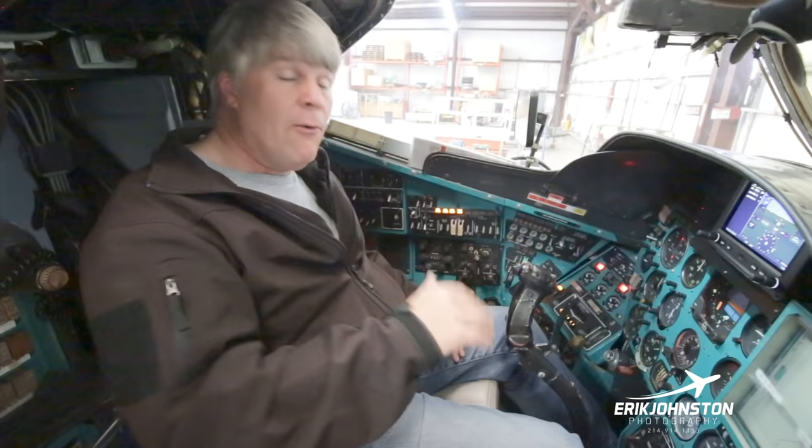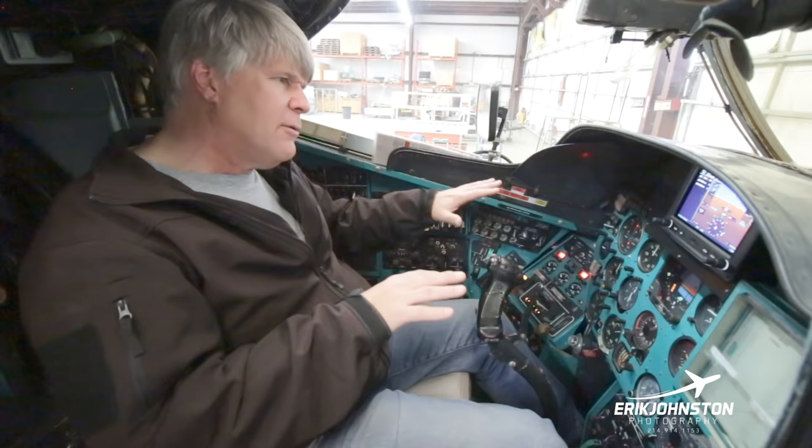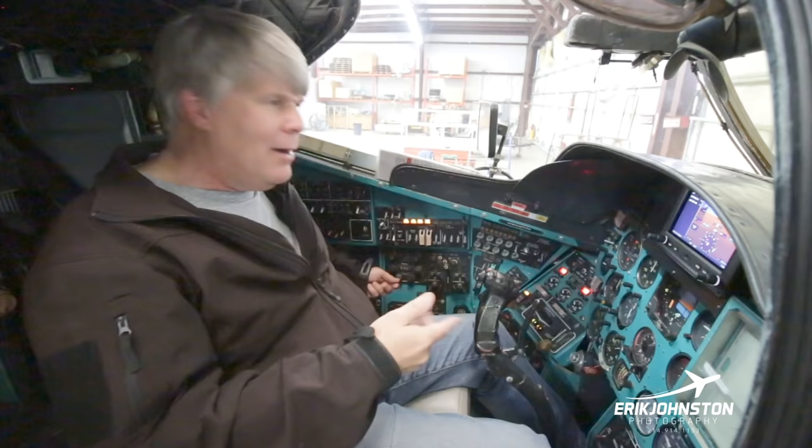On this aircraft, just to kind of even out the starting of the first engine and the second engine, number one on the left, number two on the right, what we do is on odd number days, we start the odd number engine first, and then on even number days, we start the even number first. And then how do we keep up with that? Well, if we start the even number one first, then we start the odd one second. So we're going to be in the left position. And the second time we're here, we look down and it says left. So even the pilot doesn't have to think about that kind of system. It's almost pilot proof, if you will.